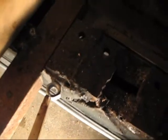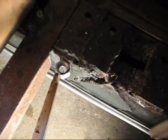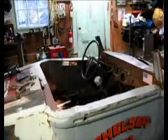Here's what I was talking about. I'm going to weld that nut right in the frame, put the carriage bolt right down through it, and pull the oak piece down tight over that. Getting the nut located was the hardest part — I looked like a magician. I had mirrors and clamps and everything else over there. I looked like a rat rod surgeon or something. I'm going to weld that in place, test it, and if it works, I'll put it down on the board.